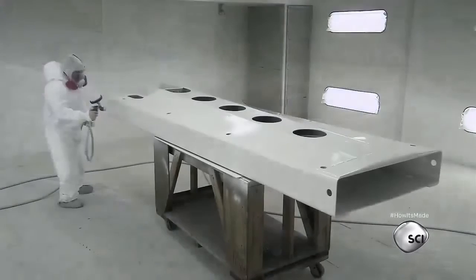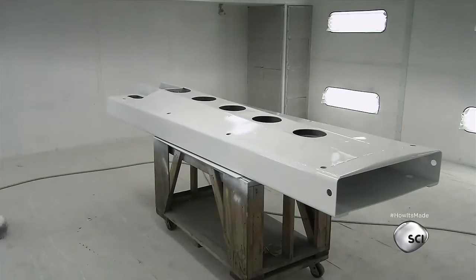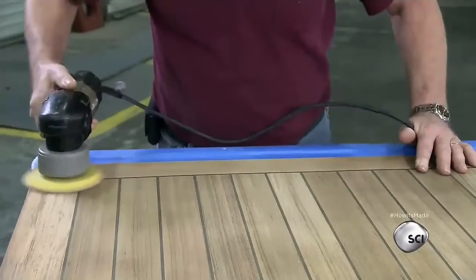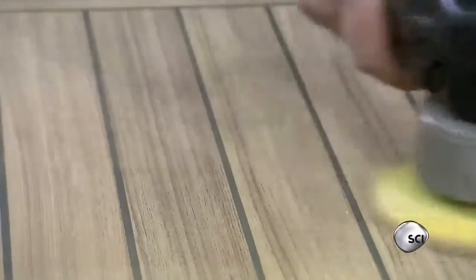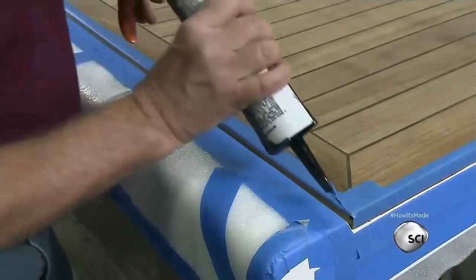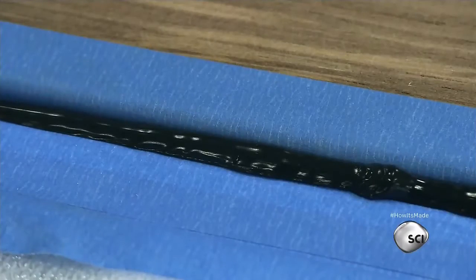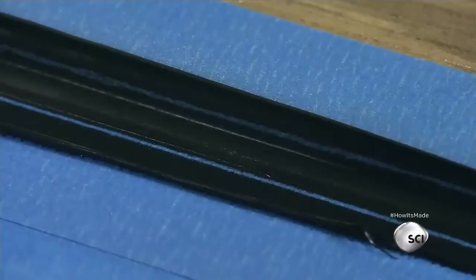This particular gangway is being custom made for a luxury yacht. After assembling the teak decking to the planks, a detail person sands the surface. This ensures that the synthetic rubber caulking between the planks is flushed to the wood. He then caulks the space between the decking and the metal plank structure using more synthetic rubber, and with a putty knife scrapes off the excess to form a neat concave profile.